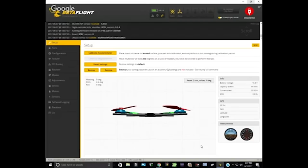But that doesn't necessarily explain what's happening here, and there's another issue that it raises. I wonder if we set min throttle to like 1168 and then do the arming test again, will motor number three keep spinning? Let's do that first. Okay, let's see if that's why motor number three is stopping. Because min throttle was right at the absolute minimum, and it needed to be higher. Should I disconnect from Betaflight to do it or leave it connected? No, go ahead and go to the configuration tab in Betaflight. Okay.